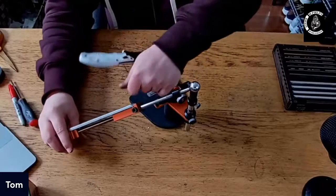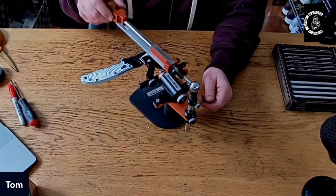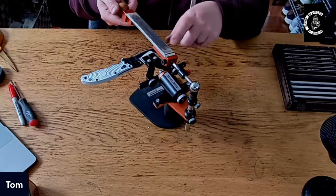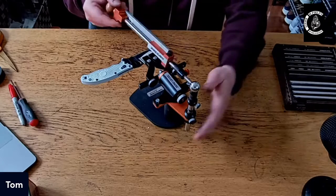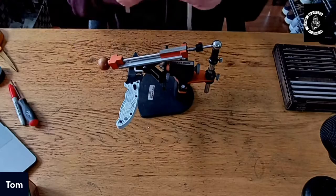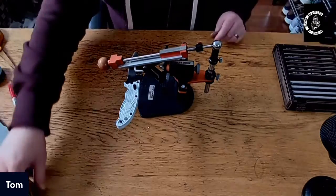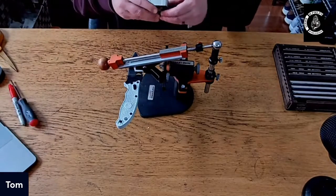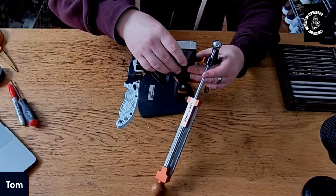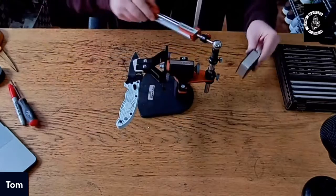Okay, flip back over to side 1. Now, when you're stropping, you only want to do pulling strokes and then lift, because if you push into the edge with the leather, you'll cut it. Before we do that, our last stone we used was thicker than this strop is, which means the angle is no longer the same, which means we need to readjust the angle back to 17 degrees, which is part of the reason why I like always having a known angle.